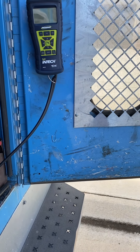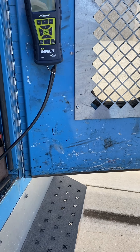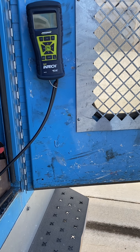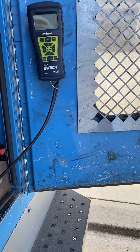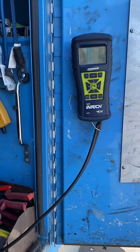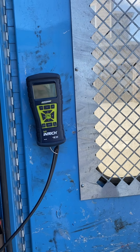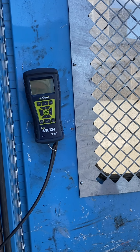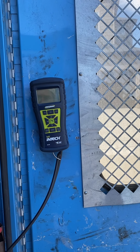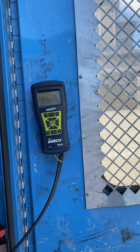Normally the technician will have a smaller version of something like this that does carbon monoxide detection, and 99% of the time it goes off instantly and everybody freaks out. This one is obviously different — this is actually a combustion analyzer. This is how we set or check the burn rate on the equipment, and when we're trying to adjust gas pressure and all that.